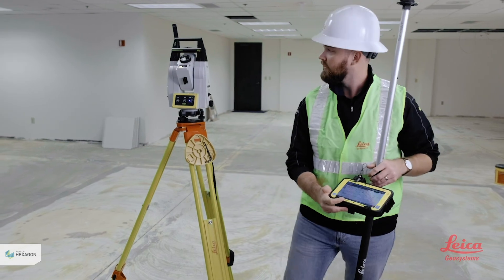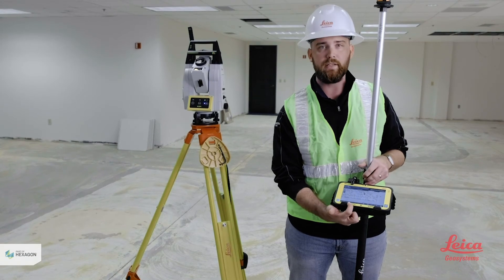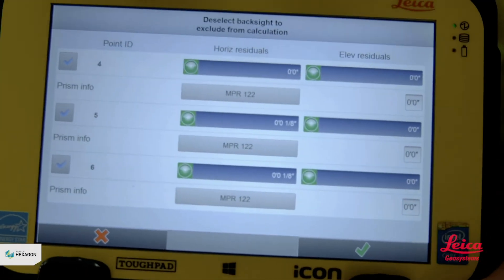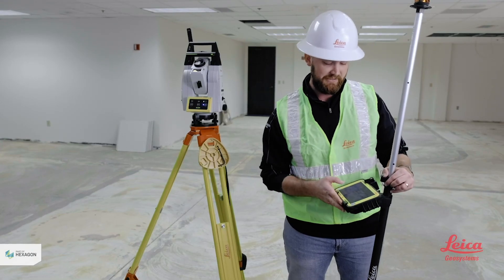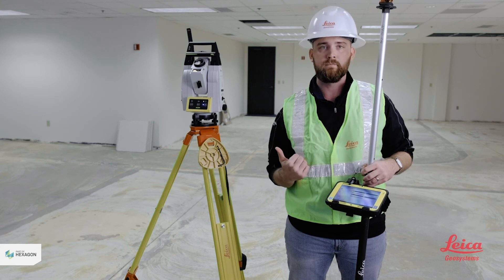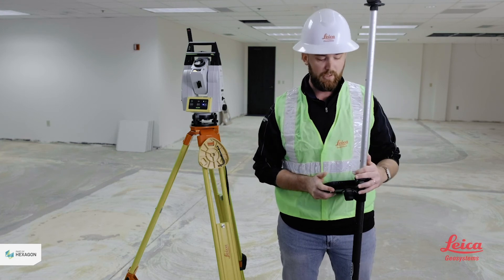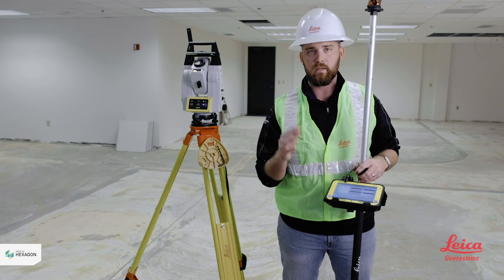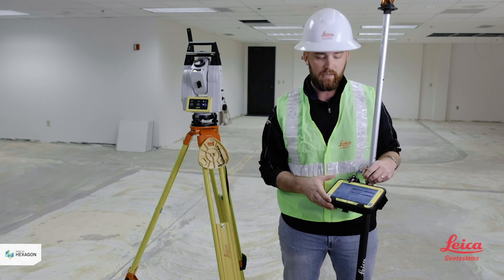Once you hit two or more control points, a new button opens up — a green ribbon icon. If you tap that, it lets you see how accurate you were when selecting those control points. For instance, this one tells me I'm a 16th and an eighth off, which are outside my tolerance. I can deselect one and move on. However, if I need it, the first step is to go back, re-measure it, and double-check my plumb. If it's still outside tolerance I'll just deselect it, because there's a problem with that control point — it's been kicked, run over, moved, or laid out inaccurately.